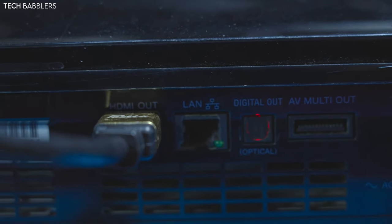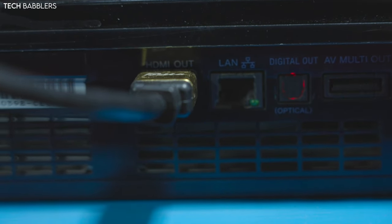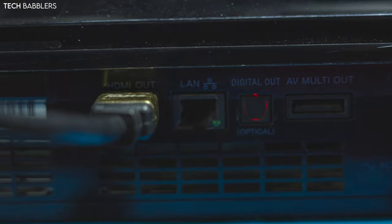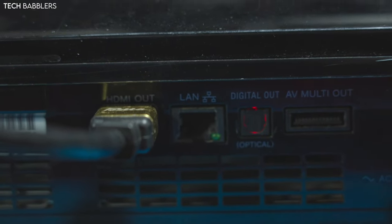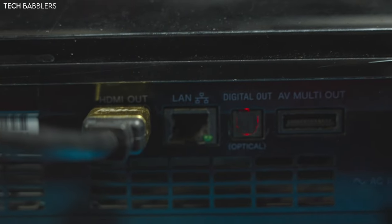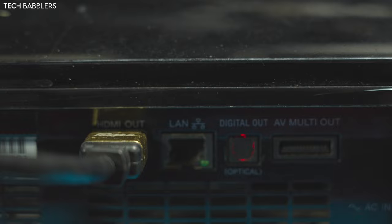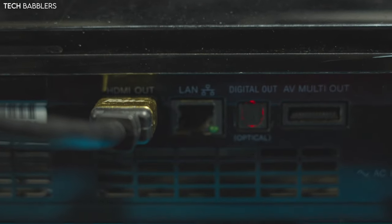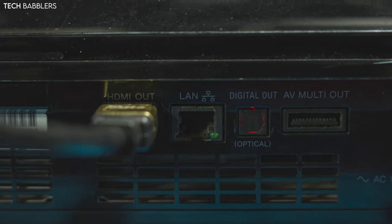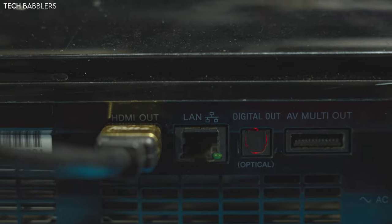I'm gonna use my quick, probably no nozzle, 500C, pretty high airflow. I'm gonna tin the points with leaded solder so it melts quicker, and we'll see how that goes. But that's the plan for this one. Should be short, should be simple, but as you guys see, that's never usually the case. So let's just get on to it.